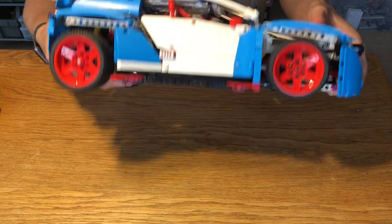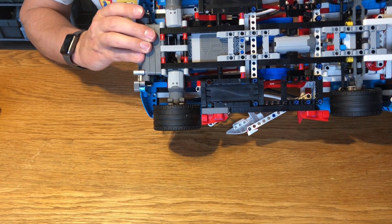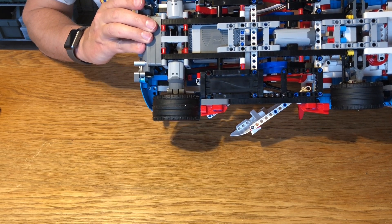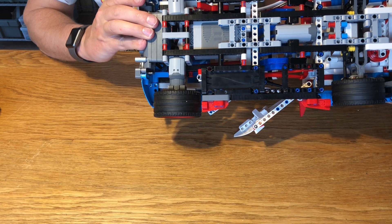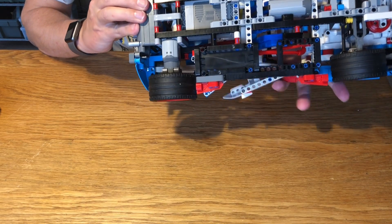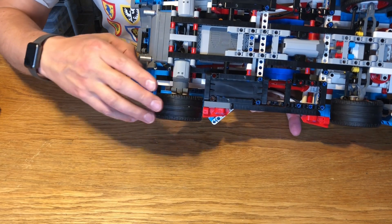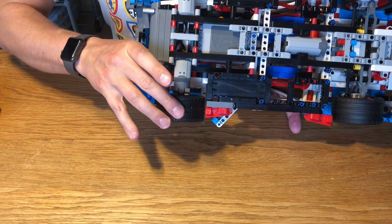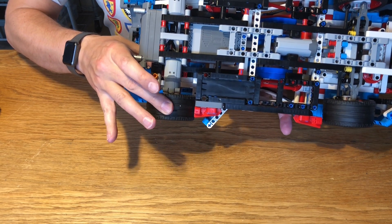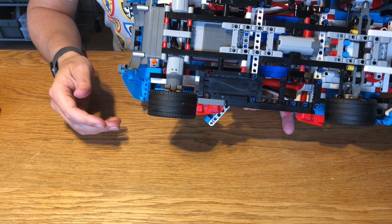The way I solve this is by putting the motors directly onto the wheels, and this has a couple of advantages. The main one is that you don't have any gears, which automatically lead to a reduction in efficiency, so the force goes directly from the motor to the wheel while still maintaining suspension — these things can actually move. The suspension is still there; the whole motor actually moves with it.